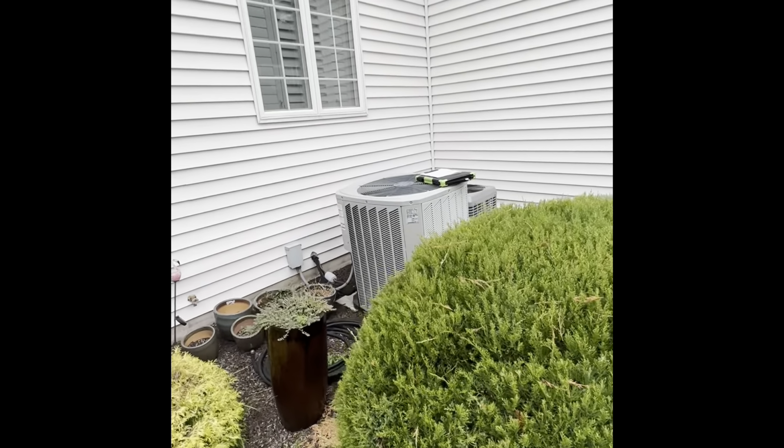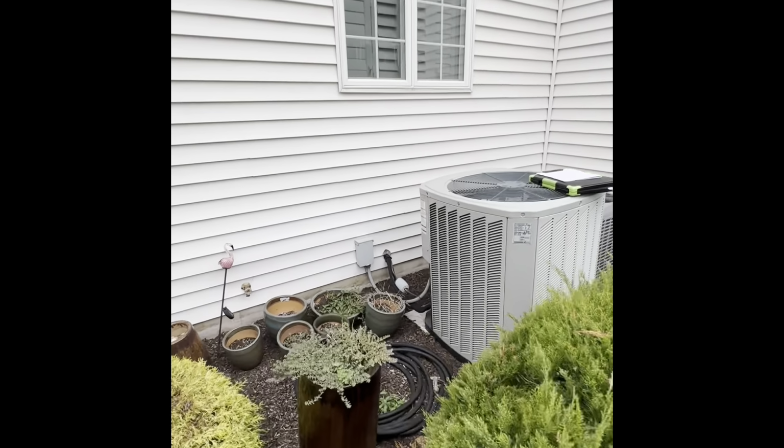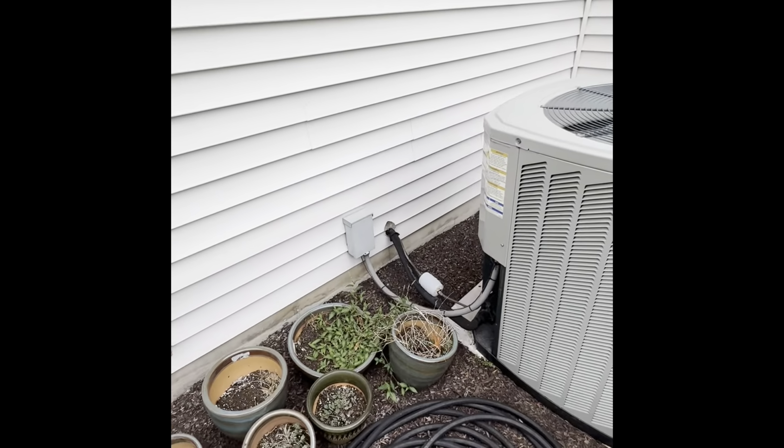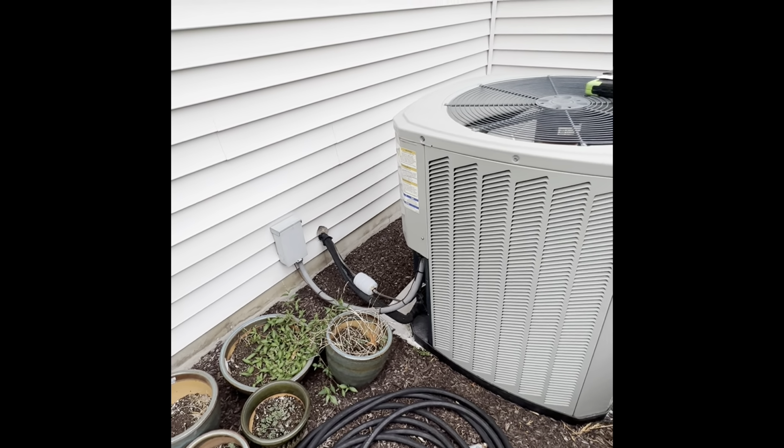Outside of the Harris Residence, looking at a possible full system replacement for our first floor basement system. Our American Standard 5-ton unit sets here. Need a new electrical disconnect and whip coming out to the unit. Flush and pressure test our line set, 7/8 by 3/8 on it.